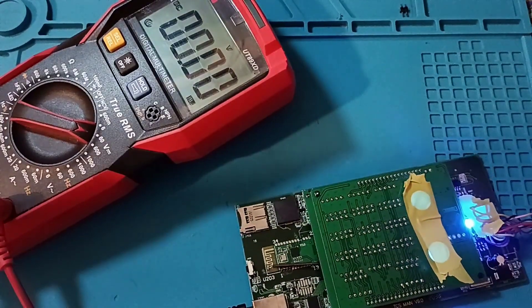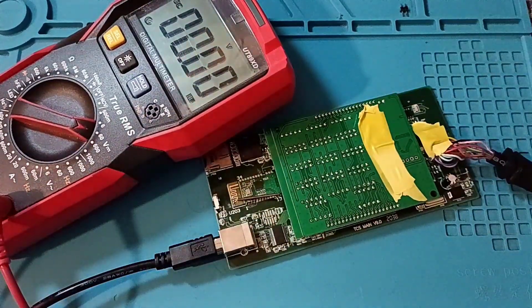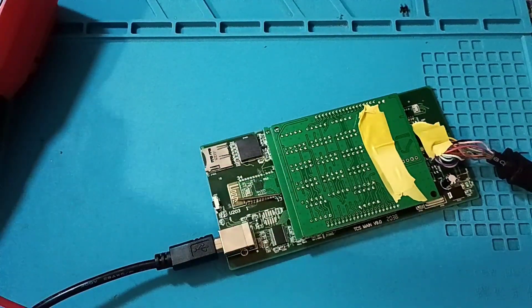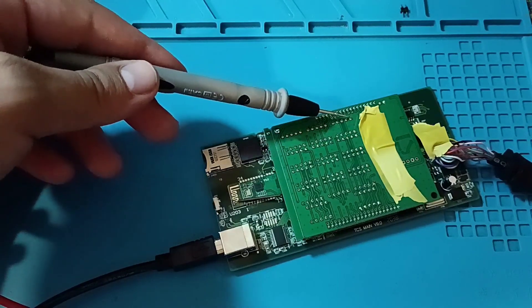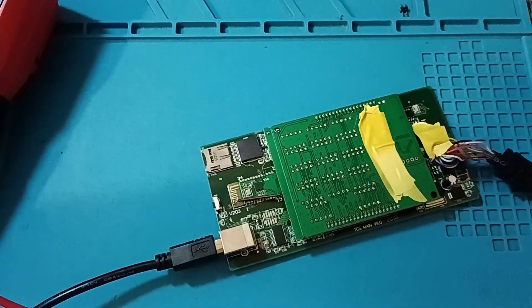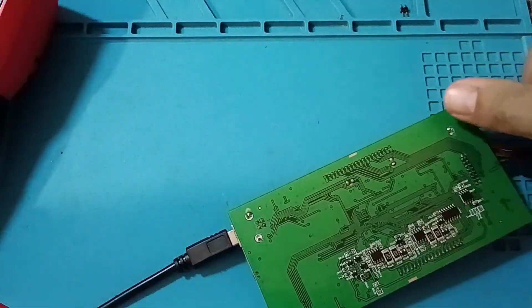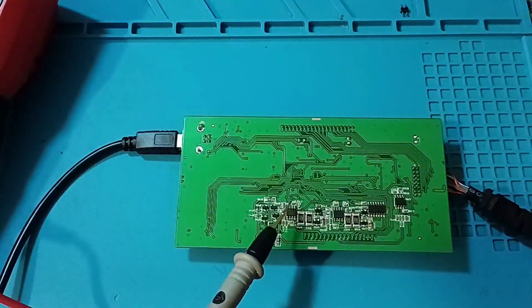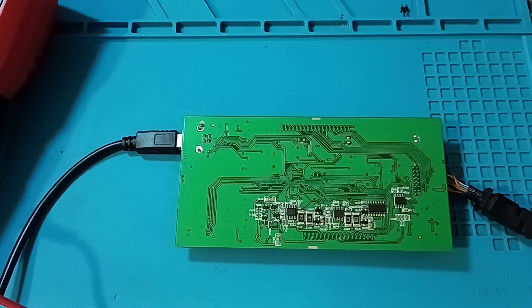You notice the very poor quality of this board. I hope now you know how to measure it and how to find the bad relay. As I said — I repeat again — you should measure the resistance between these two legs, it should be close to 190 ohms, and also the voltage should be 5 volts over there. You noticed on the back of the board this one doesn't work. I will show you on the next video how to do the rework and make this thing work again. Thanks for watching and see you in the next one, bye bye.